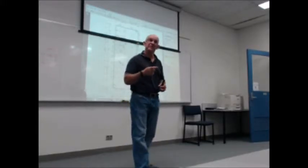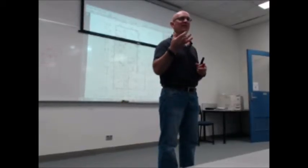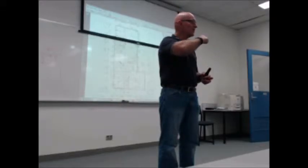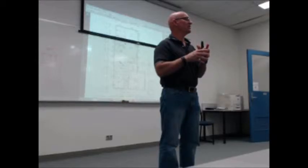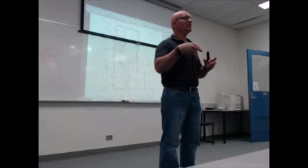You need to explain this to the client because it's always going to be a little bit different. One's a sand cement base, so it's a textured grout. The other one's a silicone, so it's nice and smooth. And you're never going to match that colour 100%. You get it pretty close. For all the time, it's going to change colour. So you need to make them aware.